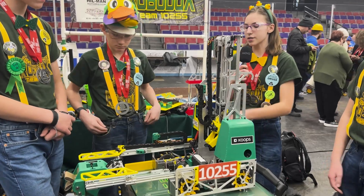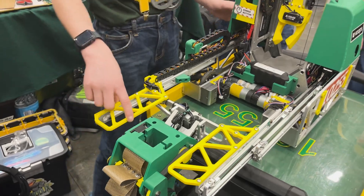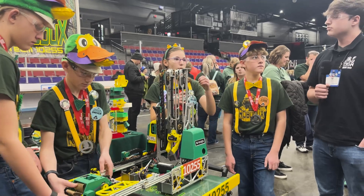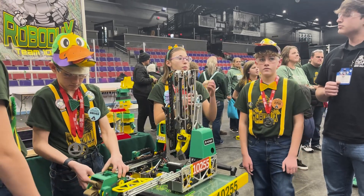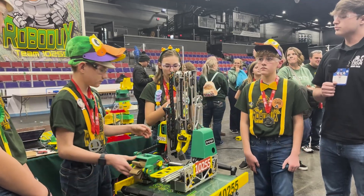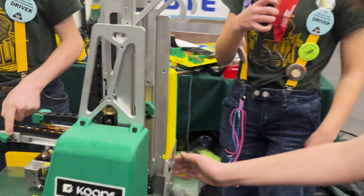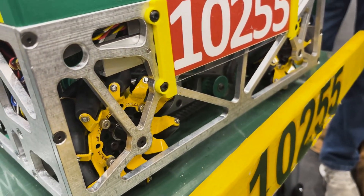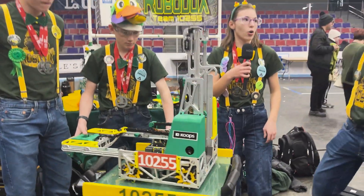We added a color sensor on the intake, and that has helped with both TeleOp and Autonomous. In our new basket Autonomous, we go from the submersible and look for a specific color — if we grab the wrong color, it'll automatically spit it out. Same thing in TeleOp: wrong color gets spit out, but if we have the right color or a neutral sample, it'll automatically pick it up and store it into the robot. We also have a magnetic limit switch for the lift — instead of having the lift touch the bottom, the magnet hits the switch so we always know the lift's zero position.